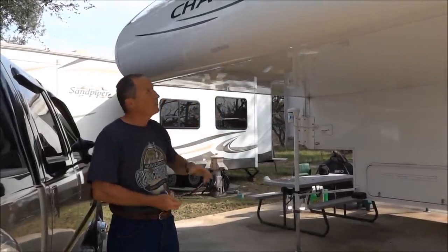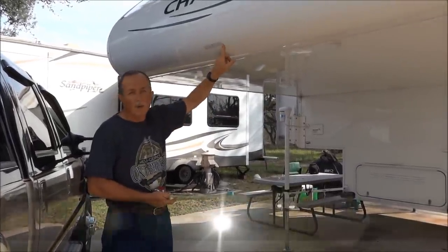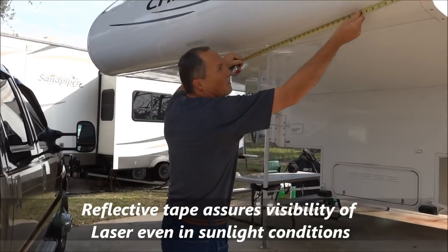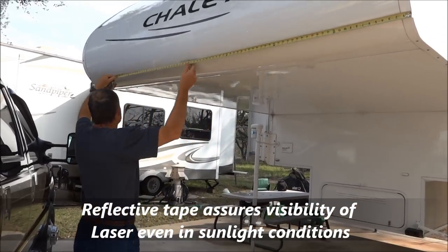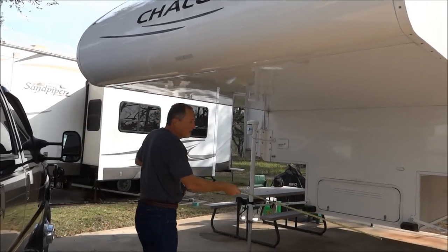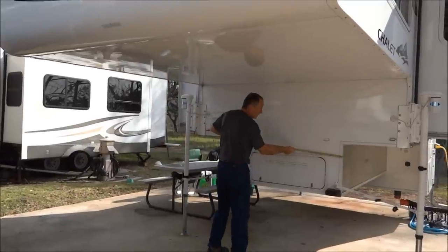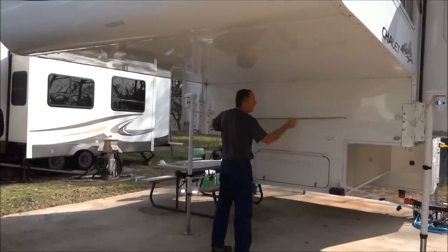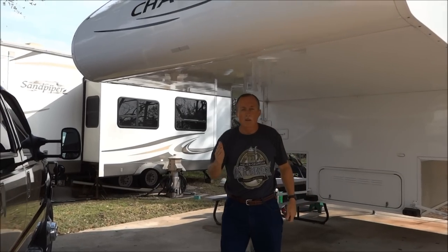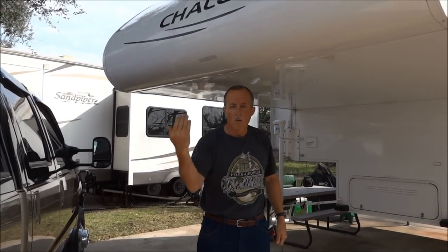The way I position these pieces of tape — this is a piece of reflective tape with a little sharpie line on it — I just took my tape measure, measured across, found the middle, and put a line there. I did that in three spots. Those three points create the plane so I know I'm going to be aligned right with my trailer.